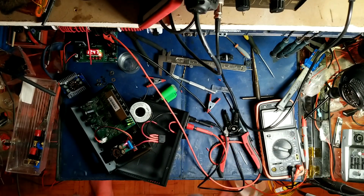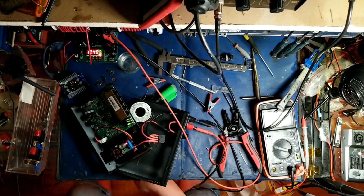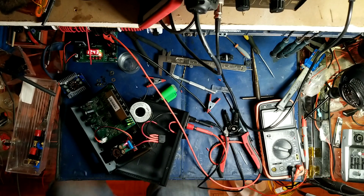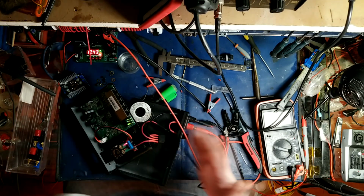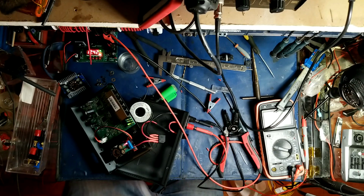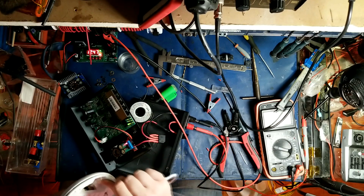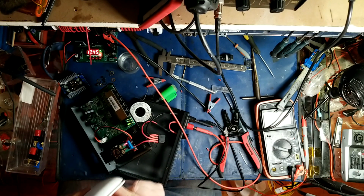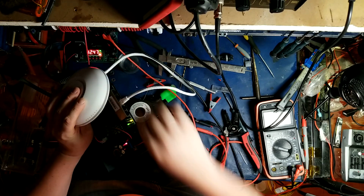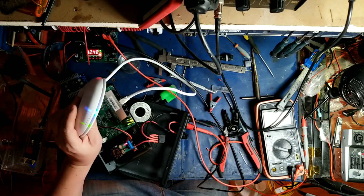Okay, so now that that's all in place, remember I'm running at 12 volts right now. Let me plug this access point back in, because basically anything from about, I'd say safely 9 volts up, will now run this network switch. So let's just put this guy in here. And would you look at that?